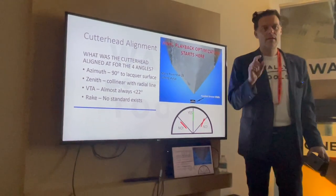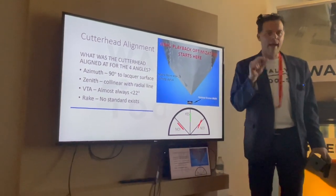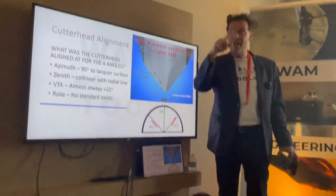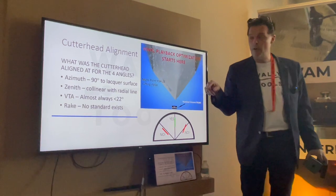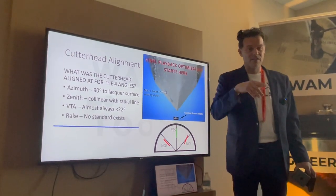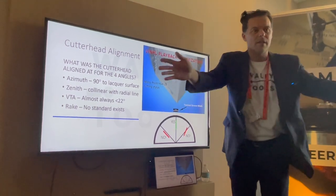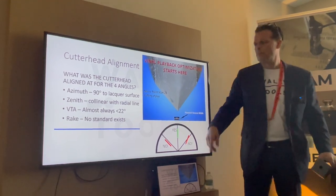Two things. One, VTA is the least sensitive to angular error, playback versus cutting, of all of these. And that's mostly because there isn't as much vertical content in the groove. Remember I told you that VTA is sensitive to vertical content, and I'll show you an animation why that's so. Most of the content is horizontal, or 45 degrees, right? But not so much vertical. And when you look in a microscope at a stereo groove, you don't see as much of these hourglass shapes. So that would be vertical content, when you're looking straight down on the groove.